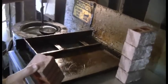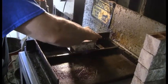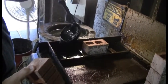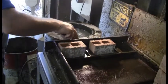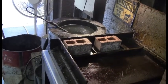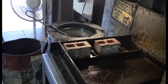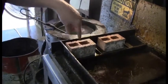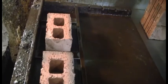He's going to put a ladle full in here, then put the brick down right in the center of that area of the mold — and with this mold you can do two. Then you're going to let it sit for about a minute, depending on how much you've put in there and the size of the brick. With a smaller brick, you don't use quite as much material — a minute to a minute and a half. You'll be able to tell when it's dry because you'll see it harden around the brick. The little puddles will turn a lighter color, and that tells you it's solidified enough to pop the brick out.